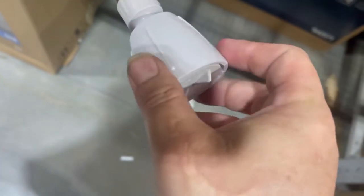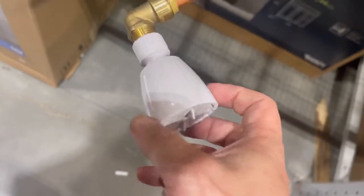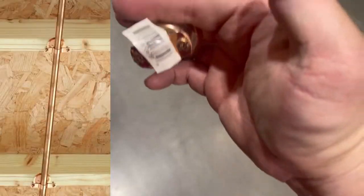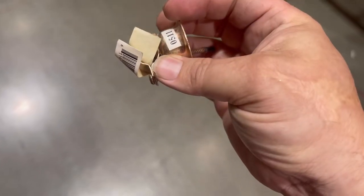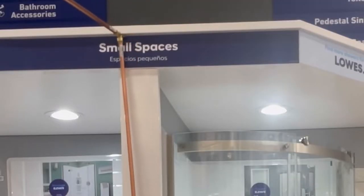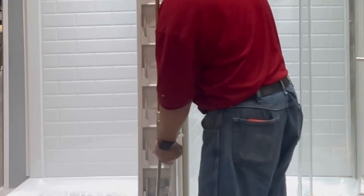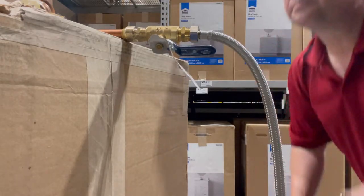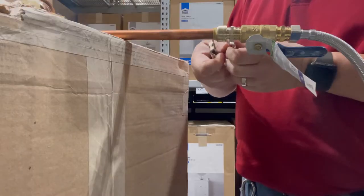With that you can thread on your desired shower head — anything from a cheap one like this to some sort of big giant rain head or anything in between. I'd recommend using a half-inch bell copper hanger to secure your pipe to a wall or stud. Remember the drop-ear elbow at the top — you can use that to secure it to the wall as well. The ball valve at the bottom turns things off and on, and you can cut the copper line to any length you desire.